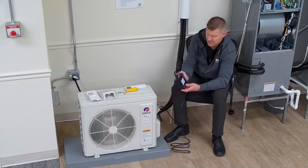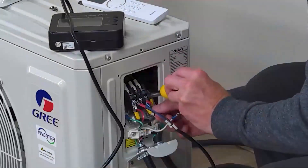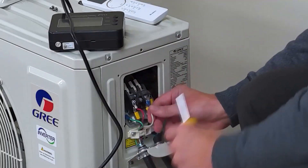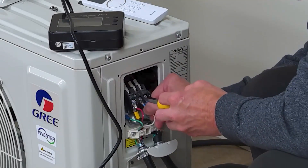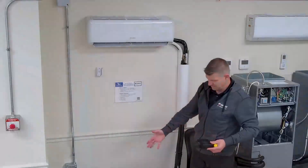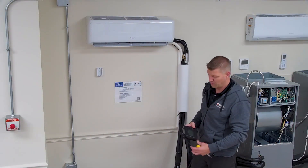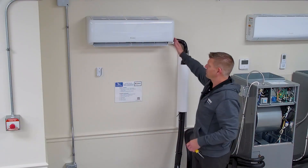So now we're going to go ahead and disconnect power. Now we're going to disconnect the testing tool from outside and reconnect to the number 2 that we disconnected earlier. We verified that the outdoor unit does not have any issues causing the E6. So we're going to hook up to the indoor head, simulate the outdoor unit, and bring on the indoor head.